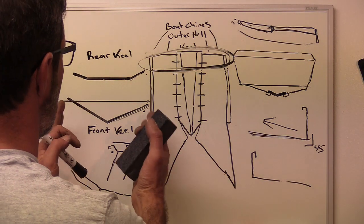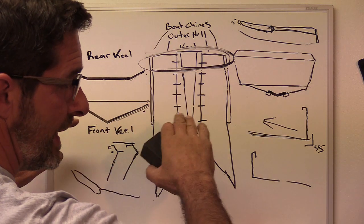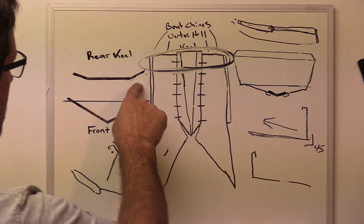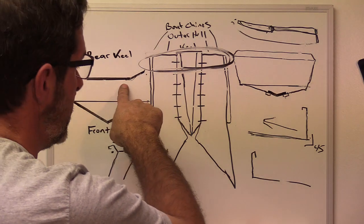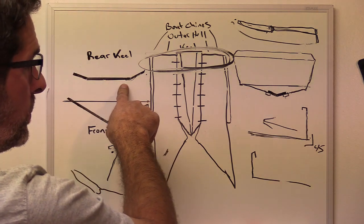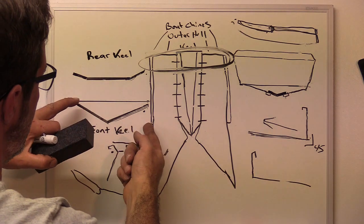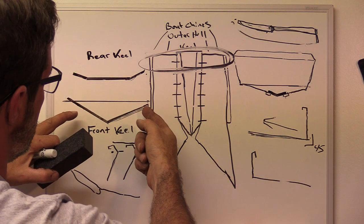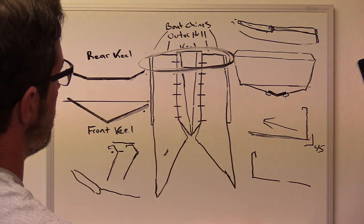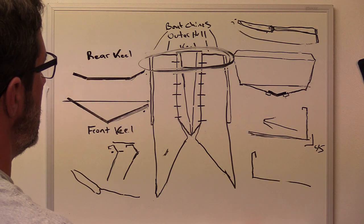You're talking about having to jig this up, get the right angles, which means actually getting the bend specs, clamping down the back of this keel on a flat and level surface, like a fab table that's 1 inch thick, or just something much heavier than this metal. And then making this conform to the jig to set the angles right and to set them even. So that's what needs to be done to the keel to get it right.